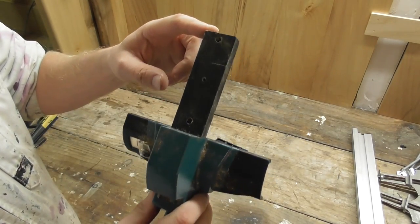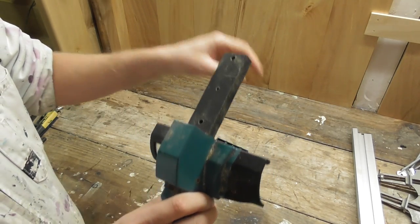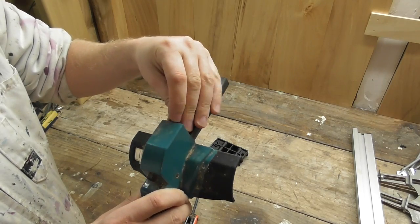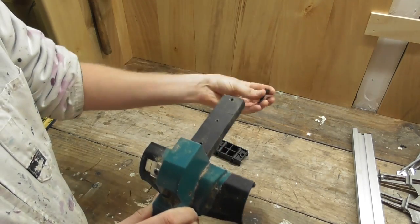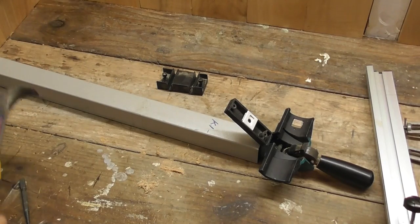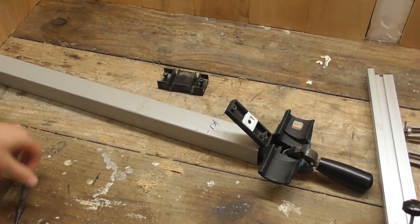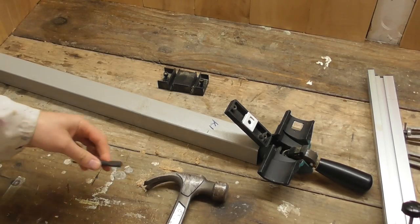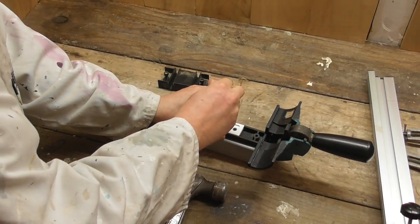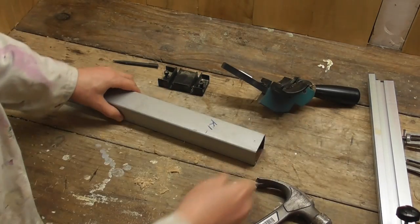What I'm going to do is bolt my steel bar onto these two existing holes here — they're already tapped — so I'll just drill some holes in my steel and bolt them back on. I can probably use the same screws, maybe need shorter ones. Before you go to too much effort, make sure your bit of steel is nice and square and straight, otherwise you're going to end up wasting your time.